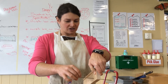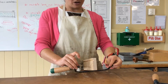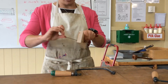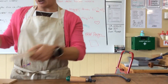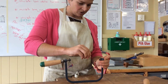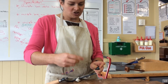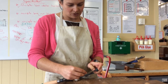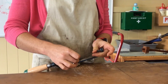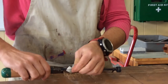Loading this correctly with the teeth back towards the handle, we can put it back into our coping saw. With the blade loaded where we want to make our cut — for this first demonstration, I'll just be cutting an exterior curve, so I'm not cutting inside. Teeth back towards the handle. There are two pins and a slot, so the blade will go into the slot and it's lodging behind a little groove there. The pins are lodging behind a little groove. Likewise on this side.